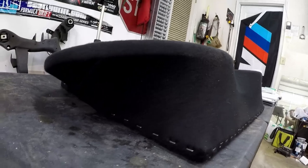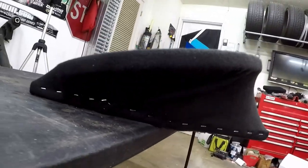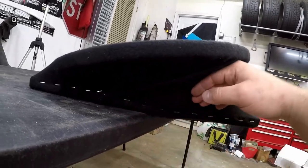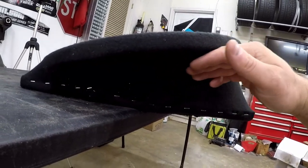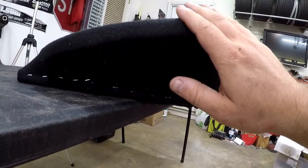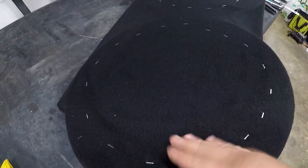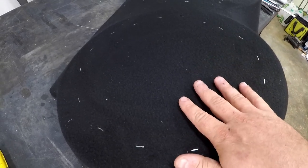Underneath here I had to fold the fabric because there was so much extra. I'm going to resin all this and then try to smooth it out with masking tape or bondo to get it back to where it needs to be. This won't be in the final form - the outside surface of this doesn't matter so much, because this is actually going to be the inside of our final piece. So this is just kind of the plug for the mold right now.